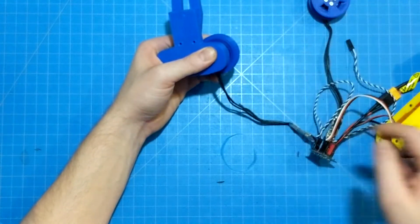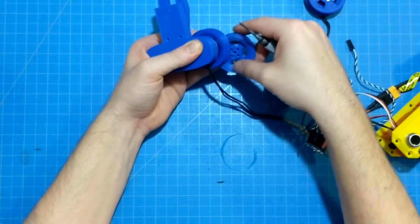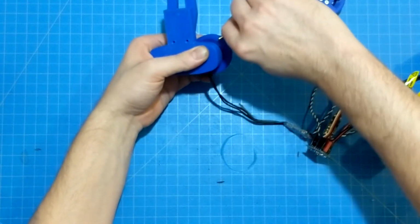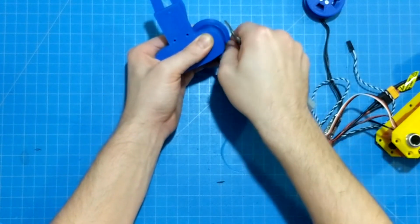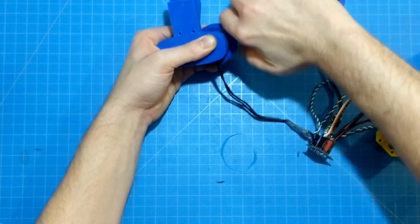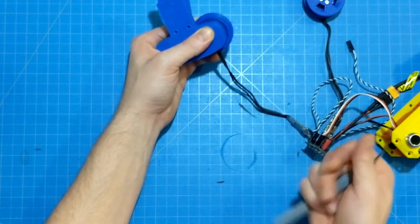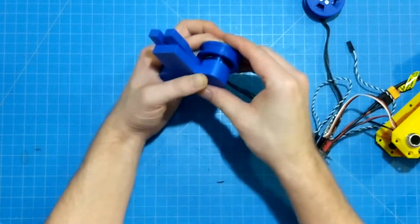I designed a sharp rim into the inside of the wheel here, and I did this very deliberately because it gives you a place that you can actually nibble off some material. So I'm going to take the reaming tool and cut a slice off of that rim, going from kind of 45 to 45. I'm actually going to do one more light pass. You want to take a tiny bit off, and if you look, this is what we're taking off, just this little sliver of material that weighs virtually nothing, but it makes so much of a difference.